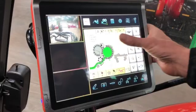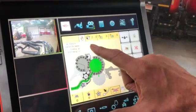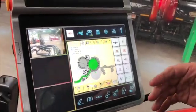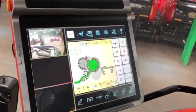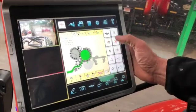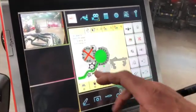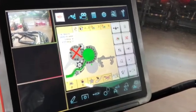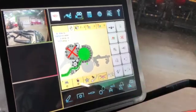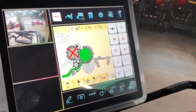You would normally be in auto, or you can operate in manual mode — for example if you want to finish your field and haven't got a full bale, you can still press the net start button. You can also turn the pre-chamber off, and as you'll see you get a cross there, and you're then driving it like a conventional baler. It will tell you to stop on the screen, and if you've got your net set on manual, that is when you would press the button to start the cycle.